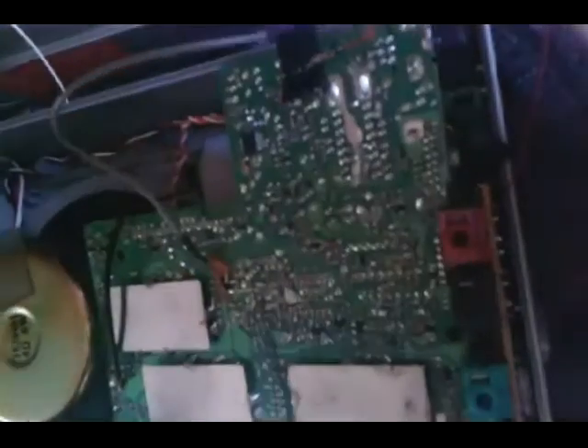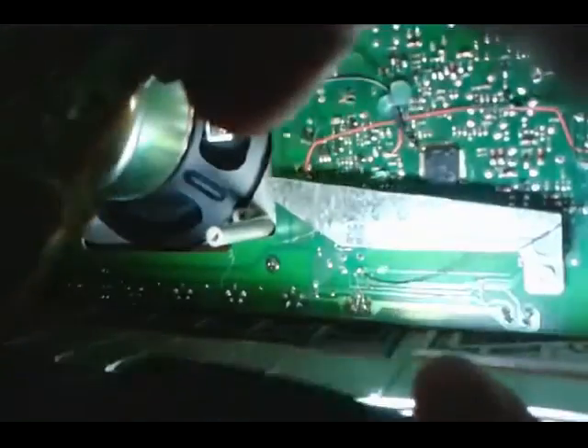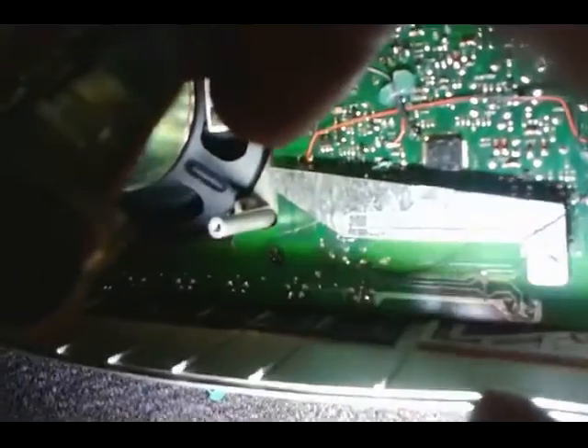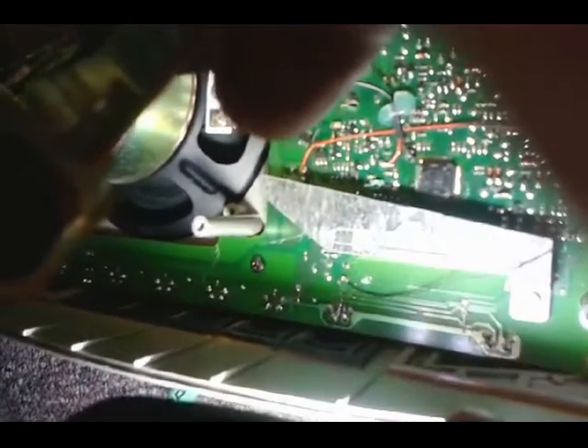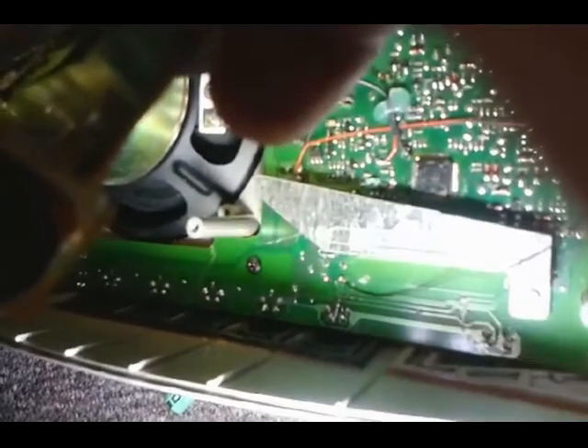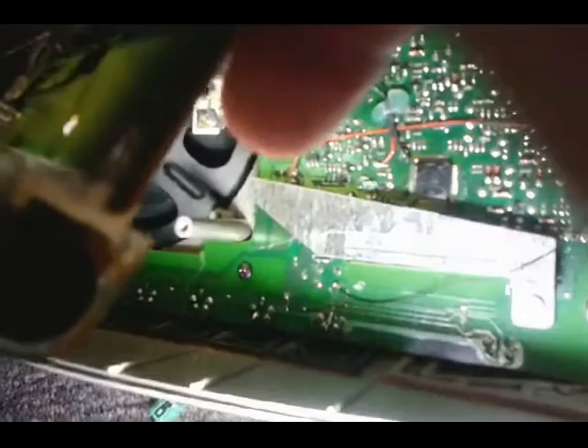By flipping the switch on, your circuit goes to ground — or by pressing that button, the LED circuit goes to ground. It's just two LEDs, so pretty simple, but it works well. I got the LCD repair all done, which was very tricky, but using hot glue to hold stuff down really helped once I got the ribbon in place, and then cutting off the extra rubber that was unused.